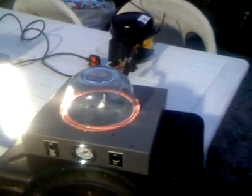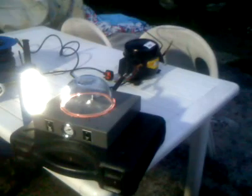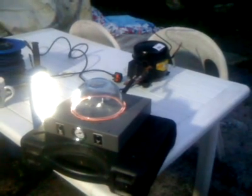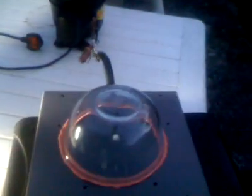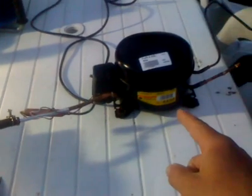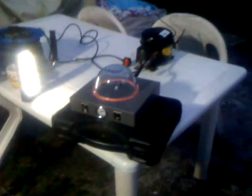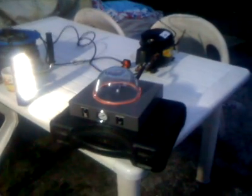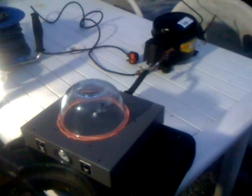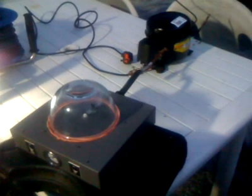As I say, it's not quite pulling enough vacuum to do what we want for the whole freeze drying thing, because I think we want to be able to boil water visibly much quicker than that. Seeing other YouTube clips, you can see how almost explosively the water boils with an industrial vacuum pump. So I think two of these in series — from the outlet to the inlet on the next one — letting them work in series — should do the trick. I'll post an update as soon as I know whether that works. That's all for now. This is Marcel in Guernsey, trying out for home freeze drying.